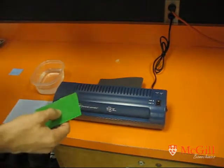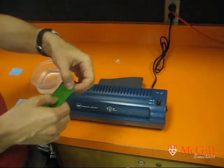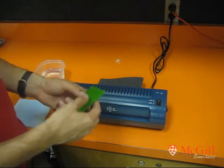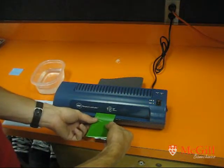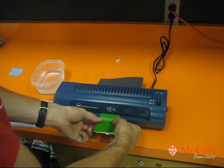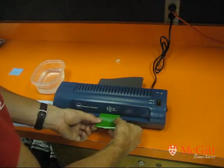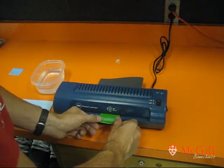Like the paper, the green toner has two sides — there's a shiny side and a dull side. We want to make sure that the dull side is down on top of the black toner. It's important that you don't get any wrinkles, because a wrinkle causes an imperfection in your toner. You want to make sure everything's tight. Feed it in keeping it square, and as soon as it grabs keep tension on the film by just holding your thumbs at the tips.